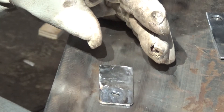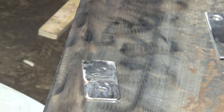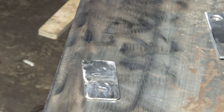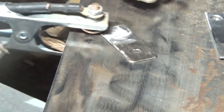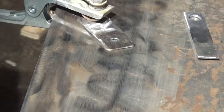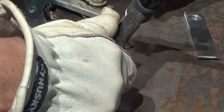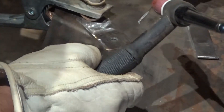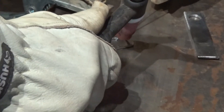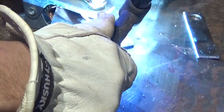After a bad start I went ahead and ground it flat again and I'm going to set it against this table so it can trap argon a little bit better. I was thinking that was why it burnt out — because it didn't have shielding gas on the backside. Putting it against the table did seem to help, but there was still a problem. You can notice it does more sizzling kind of like a MIG welder, and I'm getting a lot of oxidation — some white powdery stuff.